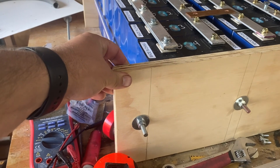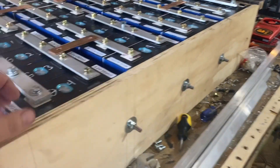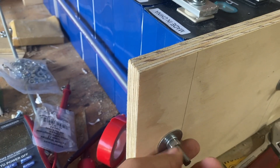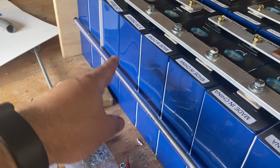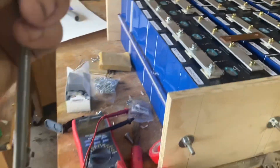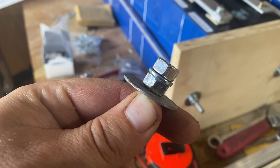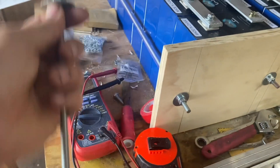Let's start with our outer casing. We're doing a variation on the method that Lithium Solar and so many others have done. We've got a board running across here — this is three-quarter-inch-thick BCX ply from Menards. Then we've got threaded rod with a washer. What's really important here is I'm doing a vinyl sleeve to keep it protected against the cells themselves. Here's one piece of rod I haven't put in yet. On the backside I did a nut, a washer, a lock washer, and another nut to act as a good anchor, then a big fat washer behind there. It just threads right through, then I put the vinyl on.